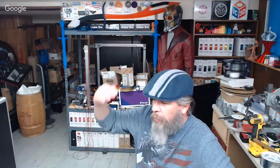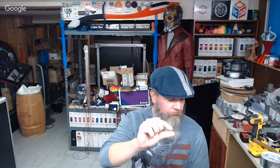Yeah, because the way I'm setting the printer up, I'm setting it to where it's going to zero just above the Build Tack sheet. So you should be able to run it across at 0 and it's not going to touch anything. Yeah. Once you got it zeroed, anytime you print, I just wouldn't advise printing at 0.1 for the first layer. You don't want to scuff, because you've always got that little bit of a lip around the nozzle, and since you're sitting at 40 on the opening. Yep.